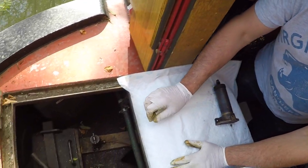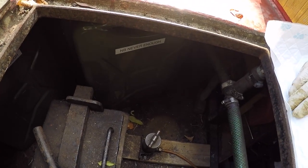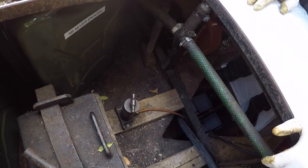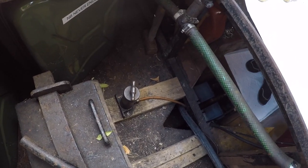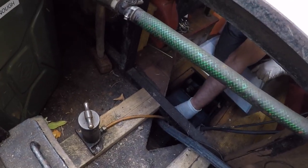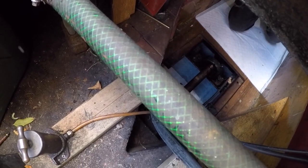As you can see, our greaser is at the bottom of its travel, so it wants topping up. This one's all linked in and the tube goes down into the bottom of the stern tube just down here. There's a main adjuster down there — more of that later.